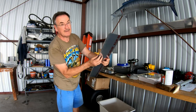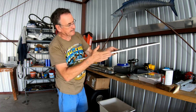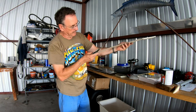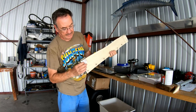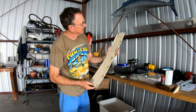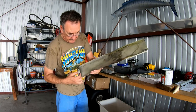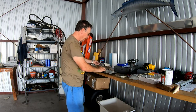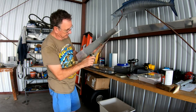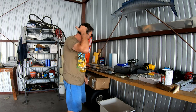So I made a new piece and I put a nice lip onto it, which will be sitting against the fuselage — a nice radius so it will seal up against the fuselage. And this is the piece that goes at the trailing edge of the wing, which was cracked. I put a patch on it a couple of years ago because it was cracked and I couldn't get the tension on the top of the wing piece anymore. It's also pretty sad looking. I do have to drill out the tensioners and transfer them to the new piece. So this is going to be the next thing to do right after the wing is back on.